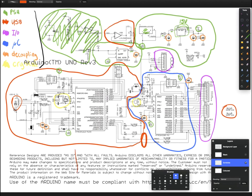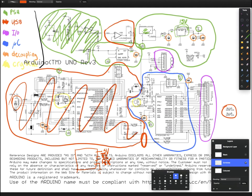Now, this means that it's effectively equivalent to just a black box, I guess, where this is ground, this is 5 volts, and then we have, I think the top one is TX, so let's go TX and RX. Everything else in that circuit, you can kind of work out based on what's going on in the microcontroller section, but we're not actually going to talk about it, because it's just too much to talk about for the moment. And then this guy up here is just an LED. It's not really that important.